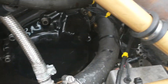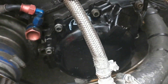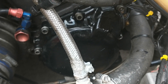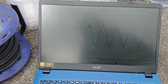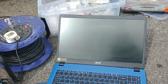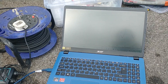I've got the other one on — the spare one. And I've got to say, whilst fitting it, I did get the slight feeling of deja vu. I don't know if that's deja vu because I've fitted these things a few times, or if I actually swapped them over at some point because I found the same problem on another generator. Anyway, what I'm going to do is hook it up to the oscilloscope again and see what happens. I've got the same across all three now, which is pretty good news. And I am wondering if that mismatched output might have been screwing up rectifier units — it's possible if there's a mismatch on the inputs that it could cause extra loading on one, and heating and all that sort of stuff.